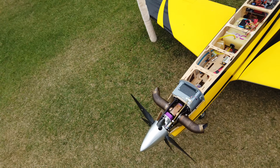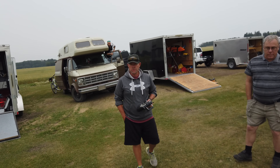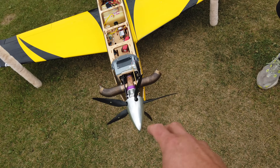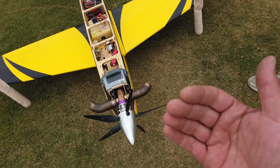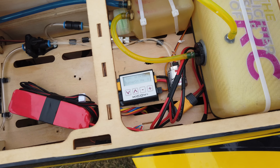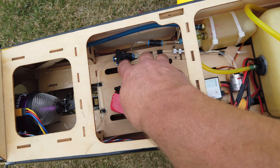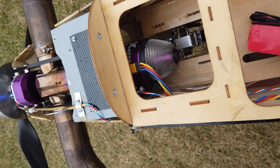The Vario prop that's been installed — Steve, what do we have that pitch set at? 22 degrees. Okay, perfect. So we're set to 22 degrees on the Vario. We'll see what we get; it might be too much for this engine detuned, but who knows. We only primed fuel to here — we didn't go all the way to the engine, so we may have to do another start. But it's pretty close.